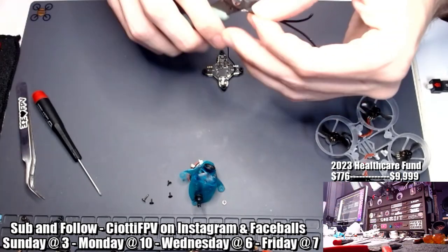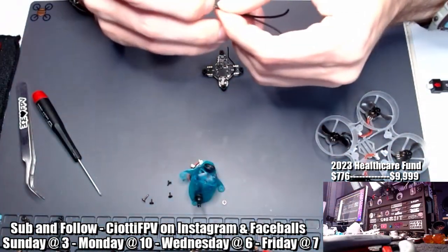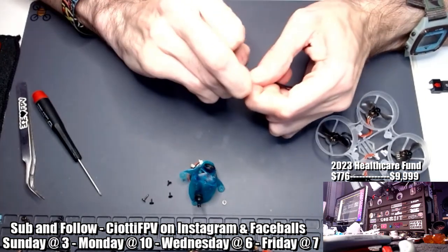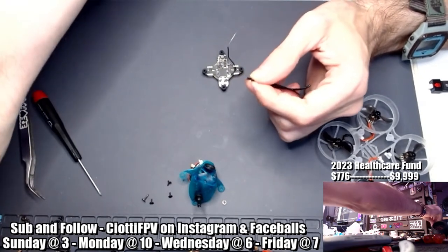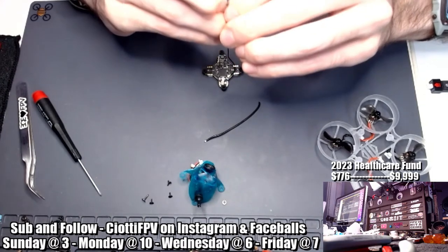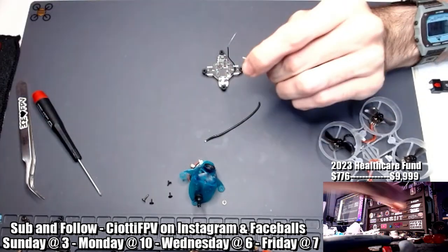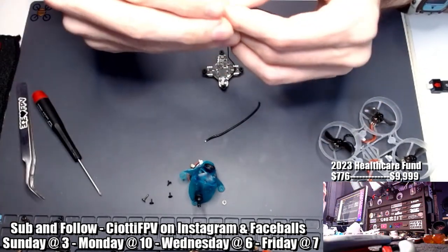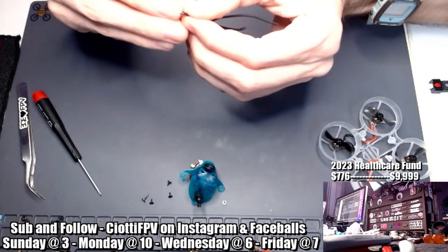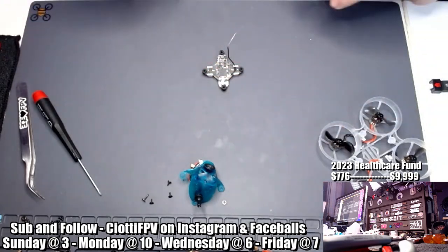Okay, we're gonna snip these off here, re-strip the ends of these with our fingernails, because your fingernails will never nick the inner strands of wire, which is important with thin little wires. Cool. And so pull that silicone back a little bit. Just give a little twist to make sure they're all bundled up.